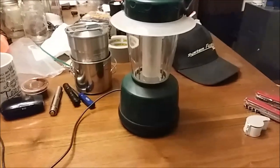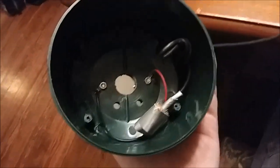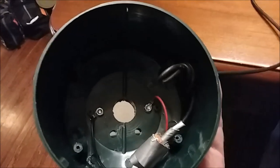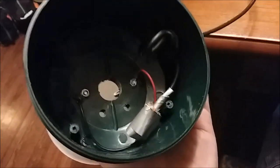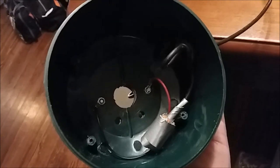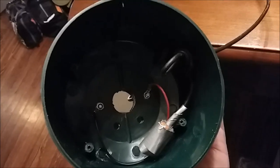What I did — let me show you — I quite literally gutted this thing. I took the support for the battery out, and that's all that was in there. Apparently all the regulating and charge circuitry is up in the top on the circuit board that contains the LEDs. So I just took that battery pack out. Six volts — well, there's something that comes extremely close to six volts: USB power banks. That technology rides at five volts.